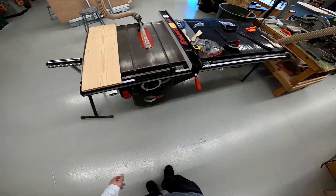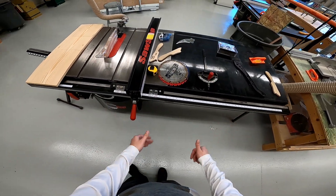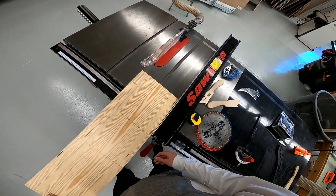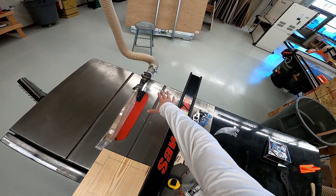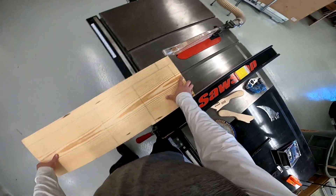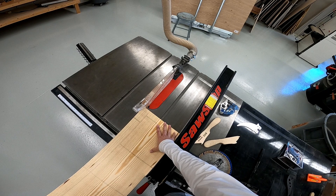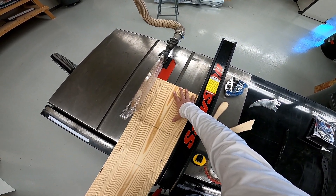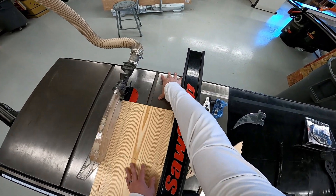Debris is clear, we're clear, everything looks good to turn on the saw and make a cut. To make a rip cut, you are going to put your hip up against the machine. This will maximize your reach and it will stabilize you, make you sturdy. And then as we go through the part, it stabilizes you to get your reach out.